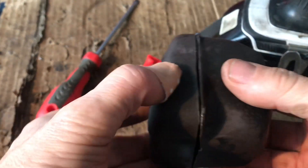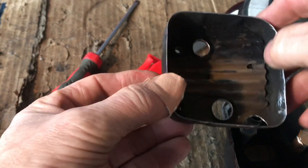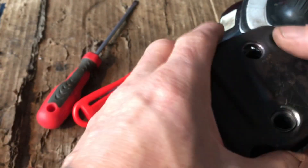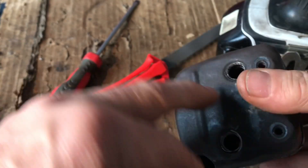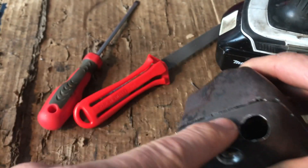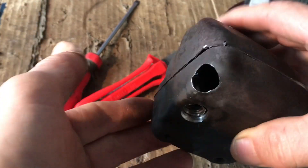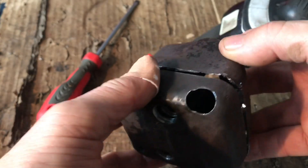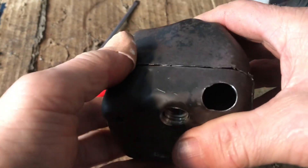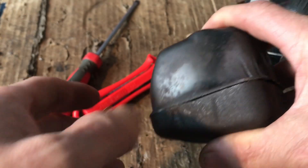With a combination of the drill and some files, I've cleaned all that up - this one particularly is all nice and clean. I'm going to connect this together now. One of those holes is perfect; this one I drilled out a little bit too much but that one's perfect. What I'm going to do is drill that out to get a nice round hole. The idea is to put an outlet that goes sort of like that - that will distort if I try to do it just loose like that, so I'm going to tack braze this all together, just put a few tacks on to get it all secure, then drill that and get it right, and then braze the whole thing up together.